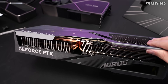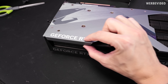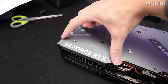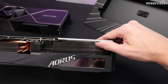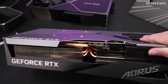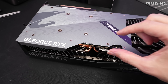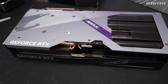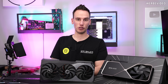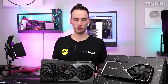The back plate gives additional mechanical stability to the card, but what's a bit odd is that especially in front you have this huge bent part of the back plate that gives a lot of stability — bending the card there will be almost impossible. Same goes for the back. But in the center there's like no bend in the sheet whatsoever, which basically makes that area the weakest point of the card, almost at the edge of the GPU. I wish they would have added more bends on the side for even more stability. That's definitely something they could have improved further. Next week we can fortunately talk about the cards in more detail. Thanks for tuning in, see you next time, bye bye.